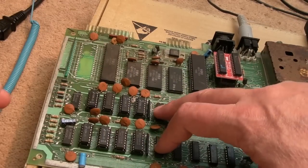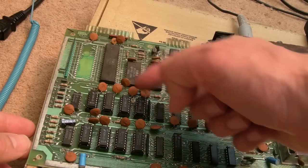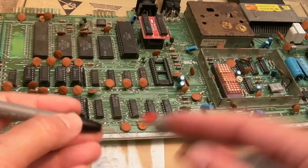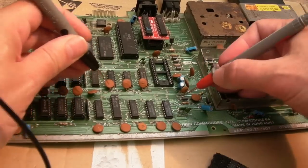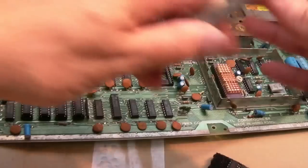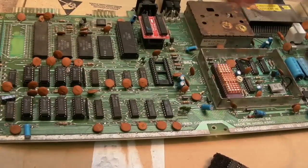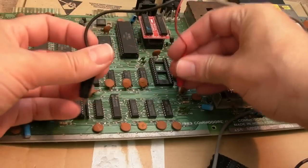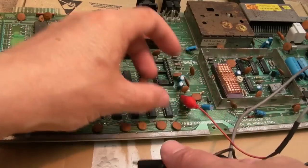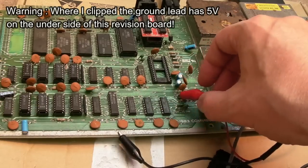I'm thinking here. So, let's get the logic probe on. Let's see if we see any weirdness on the connection that relates to this one here. The ground is easy to clip on down here on the logic probe. I need a 5 volts. Let's check this ferrite here, because wasn't it one round here before? Yeah, that's a dead short. So it's the same as that other board in a previous video, like the last one I think, or the one before. So we can clip that there. Be mindful that when it flips over like that, it could short. So just look where it is and what potential it has to short onto anything.